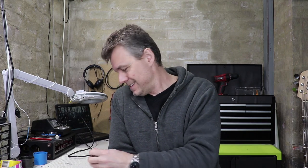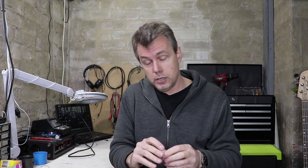Blue tack in general is a very handy thing to have around your guitar bench for guitar wiring. You can hold wires out of the way so you don't brush them with the iron and melt the insulation. You can stick pots on the back of the guitar so you can control the solder properly and get good joints without overheating the part. I'm sure you'll see me use this in a sec when I go ahead and install my little preamp into Project Berocca.